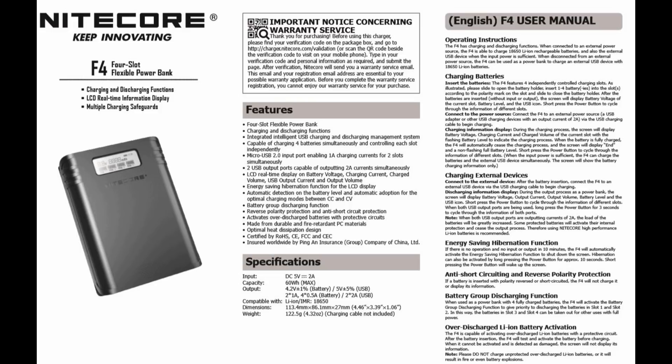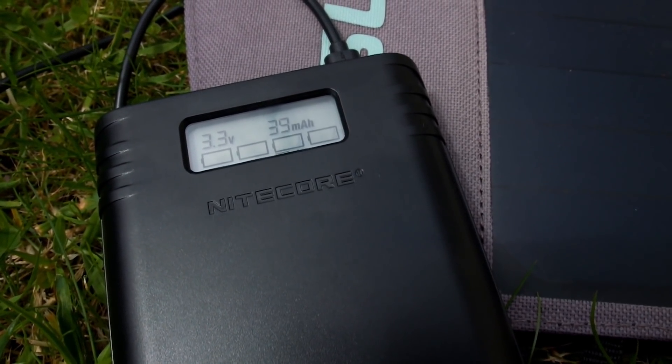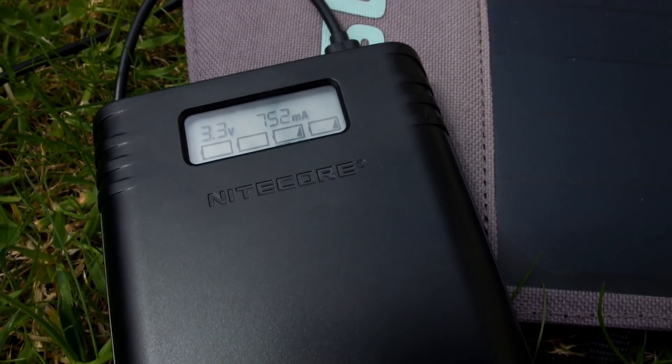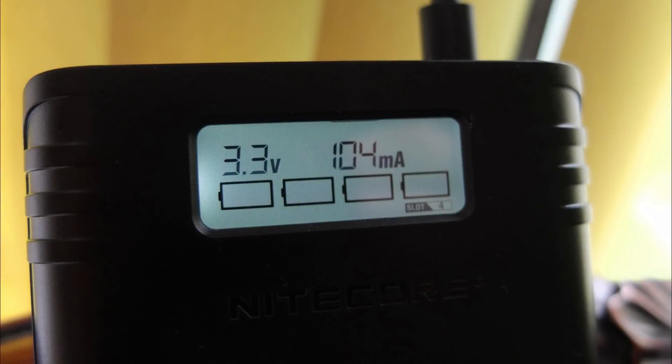This is the main section of the user guide just in case you want to have a quick look - I'll put a link below so you can download that and check it out. Solar charging is good on this because you can instantly see the charge rate you're getting, which a lot of panels don't offer. It also interestingly works at a very low rate - I've just got over 100 milliamps here and it's still charging, which is quite impressive.